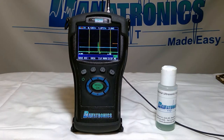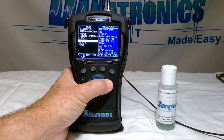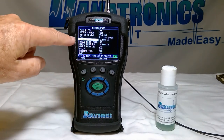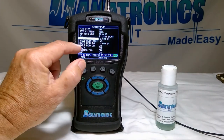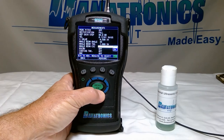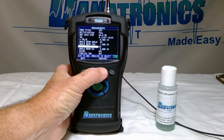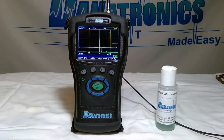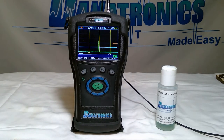One of the new features we have is our curved surface correction. To turn this on, I go down to Measurements. The angle beam is set to 45 degrees, the thickness of my material is one inch. I turn on CSC — curved surface correction — and then it asks for the OD of the pipe I am working with, which is eight inch. I press Measure, and at the top it shows that curved surface correction is being utilized. All of these readings can be saved and used in doing further evaluation. This is using the Echo 9FD as a flaw detector for angle beam work.